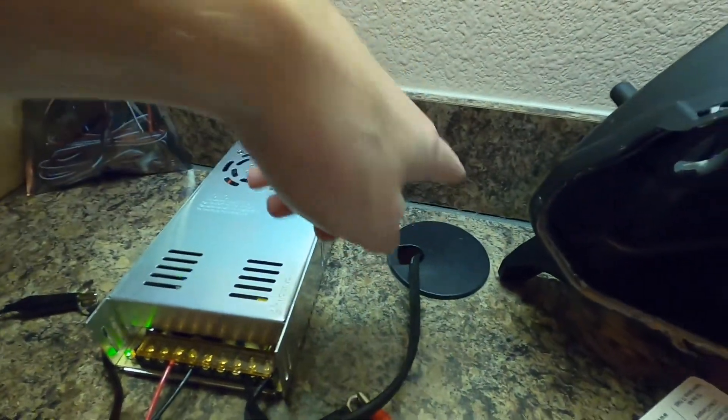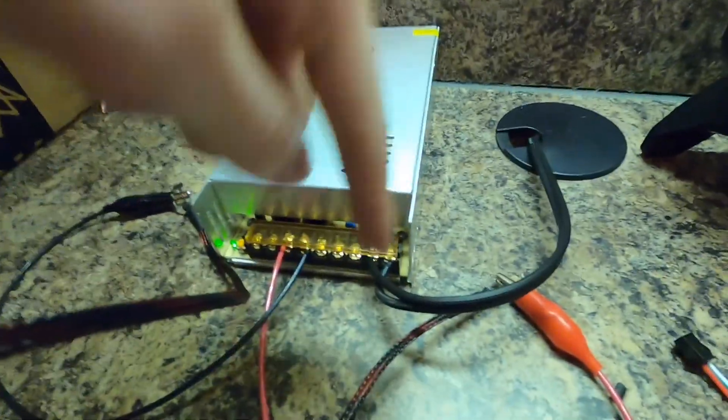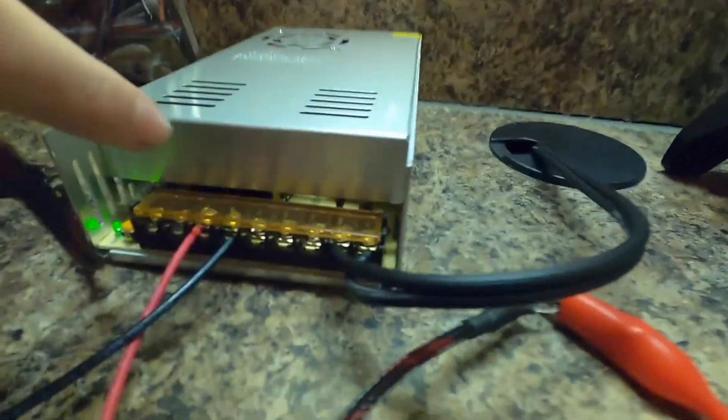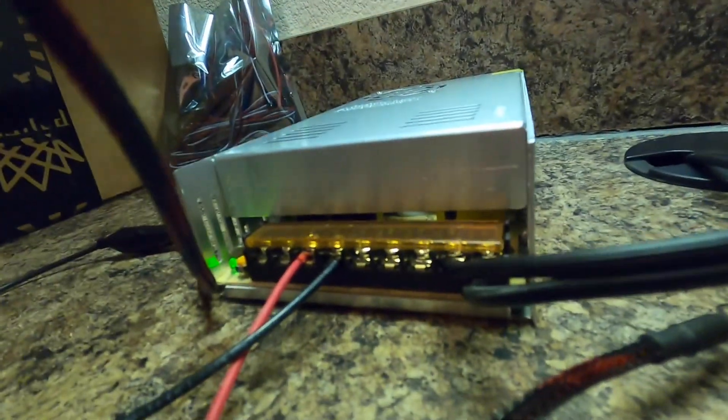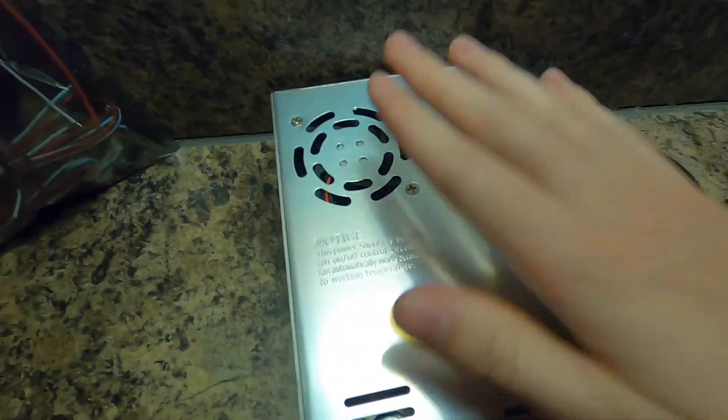Here's the whole power setup: plug in the wall — luckily there's a hole so the cord goes through — I bought two feet of cord, which turned out to be just barely enough. Alligator clips on top — super simple and it works. Wire the ribbed side to the silver screw on the plug and to neutral, and the other wire to the gold and the live or hot. This also doesn't need a third ground wire. This setup is perfect — about $20 for the power supply and maybe $10-12 for the wiring. Easy option, anybody can do this.